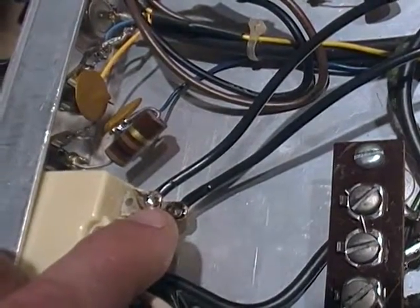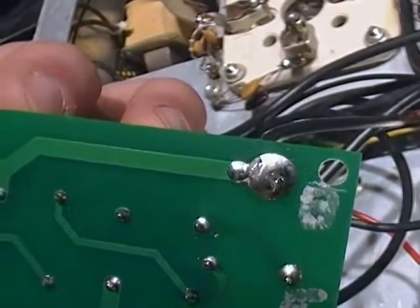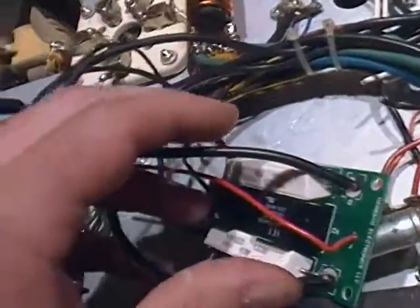And the top — same thing with leads B and D. That comes off of the soft start kit board, as you can see. The wire inside the Heathkit that did hook here is now here, soldered onto the bottom. Get a good amount of solder on there so they're good and solid. We've got a couple more connections to go before this one's done.